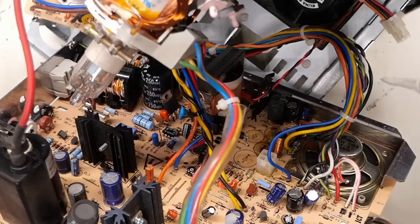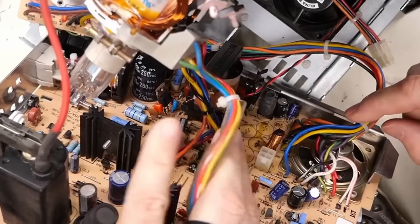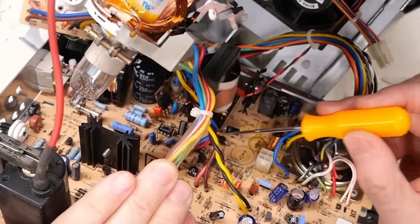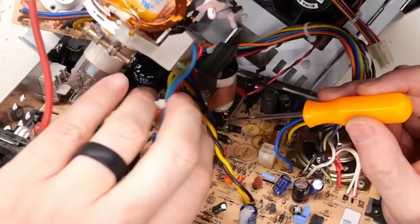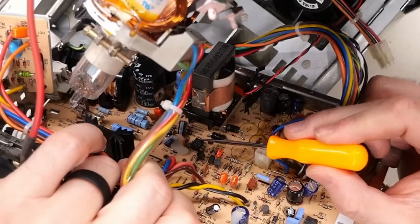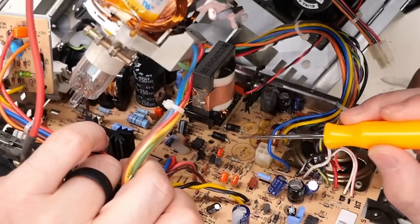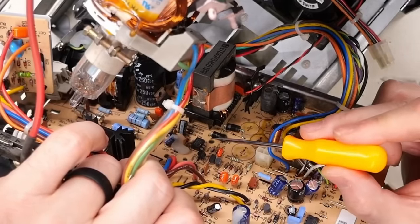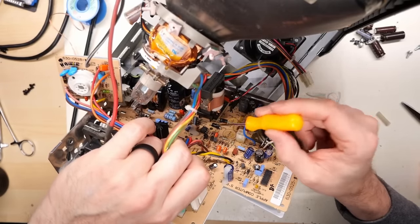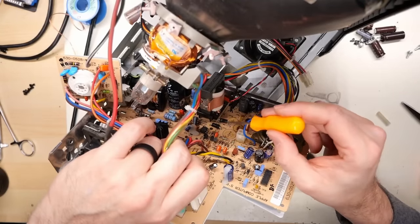Ugh. So what needs to happen now is the board on this side here needs to be cleaned up of all that leaking electrolyte. Now, one of the issues is this can leak and get onto the voltage regulator, which, if I try to move these wires out of the way, is this IC right here. And when electrolyte gets on there, this is a kind of high precision part, you start to get weird voltage outputs from your power supply. So we really need to spray a whole lot of alcohol in this area here and just flush this out of all of this crap.